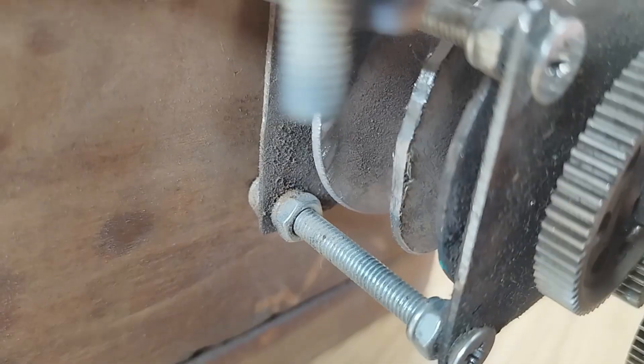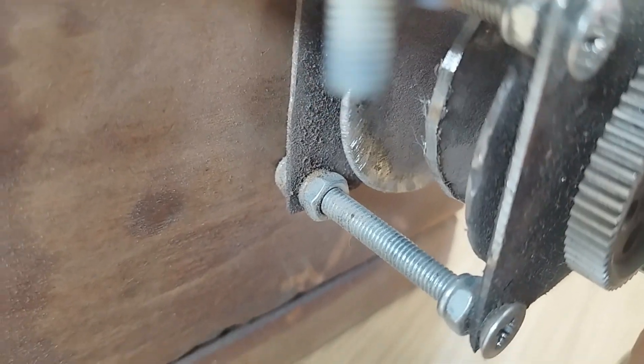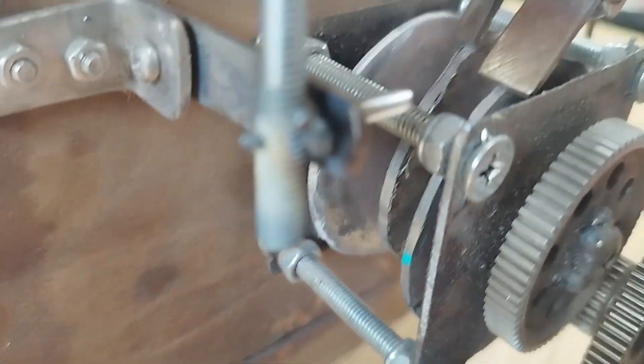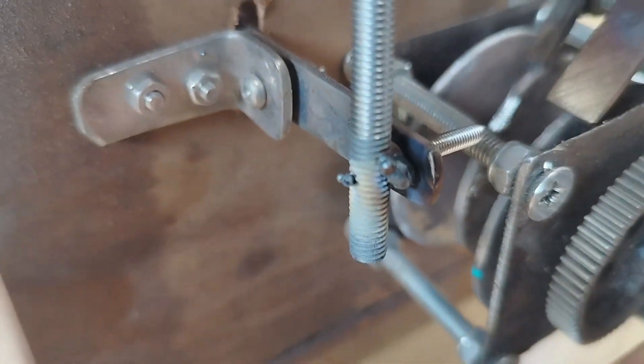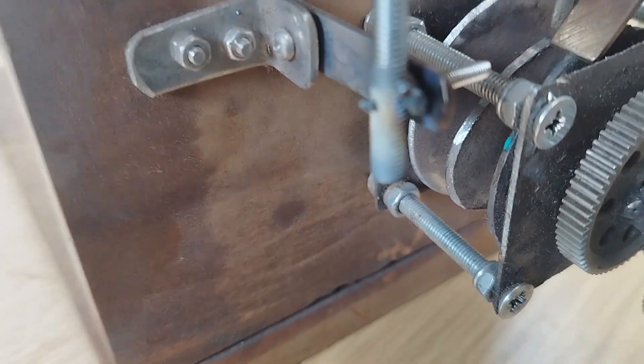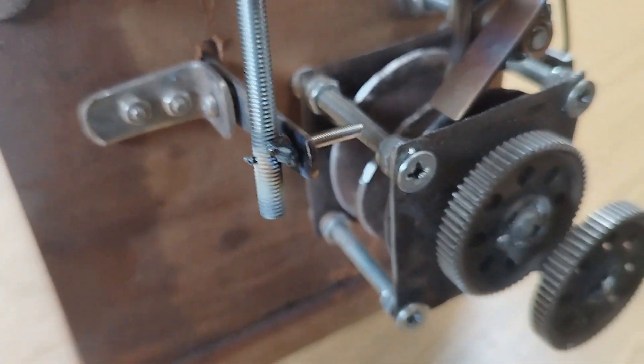I've made some marks — you can see that little bit of teal paint. Between that piece of teal paint and the other one is when I need the head to be looking down. So between those two I've got to go in and grind that section down. That's what I'm going to do next.